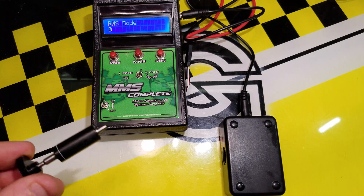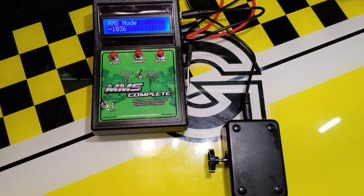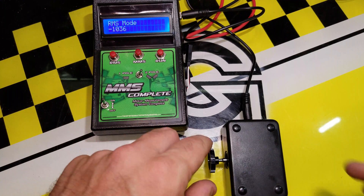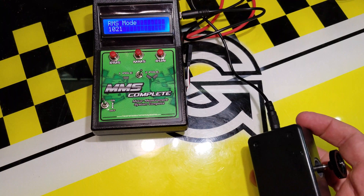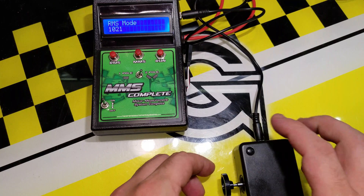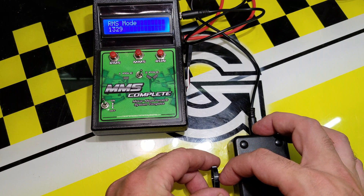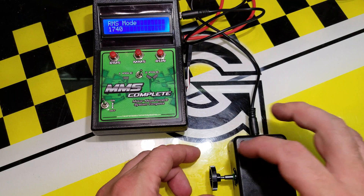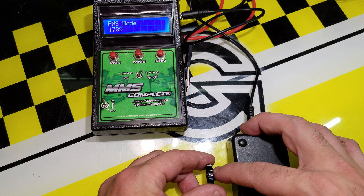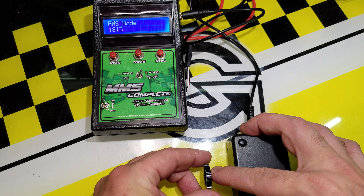Here's the second rotor. The instructions say just put it in there, but as we learned, the little sensor is in the back and isn't centered within the rotor. So I'll flip it to the north side — it's only 1,000 gauss as inserted. I'll move it around and turn it clockwise a little, pull the rotor out slightly: climbing up to 1,740, 1,789, 1,800. So this is a very high gauss rotor.